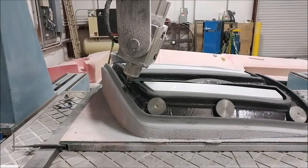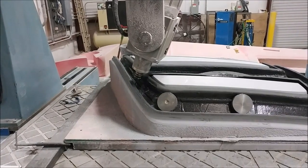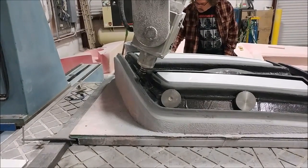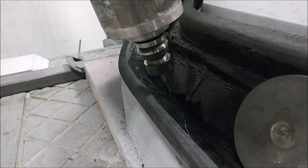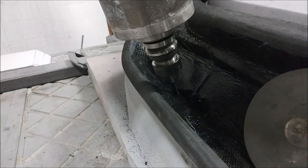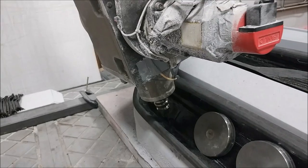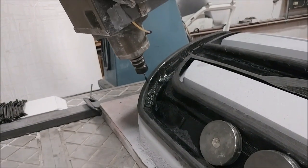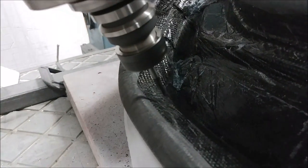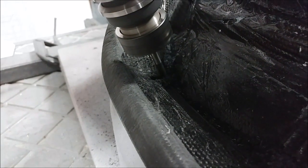The machine has now done all the trimming and is starting to cut out the door locks. There was a problem last time with this step, so now only three sides are being cut by machine, and the bottom cut is done by hand because it's tricky to reach. The larger hook lock openings are being cut out, and circular steel weights are holding the bottom edge of the door into the fixture so it doesn't move while cutting, with a bungee on the other side. The door fits snugly in the fixture, and the end mill doesn't have enough force to lift it — it drills rather than lifts.